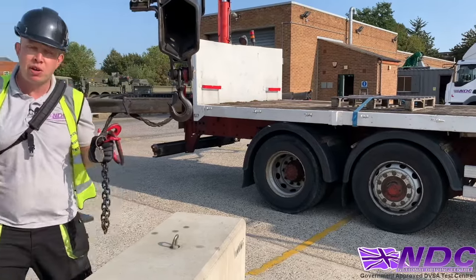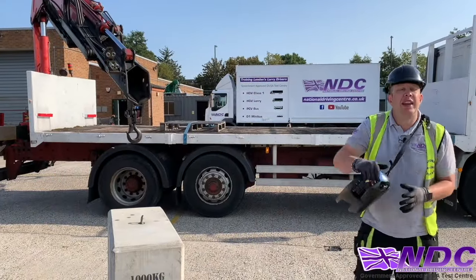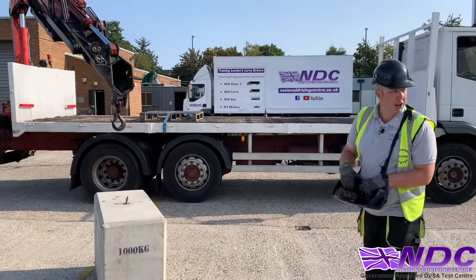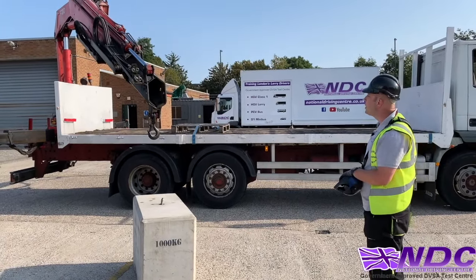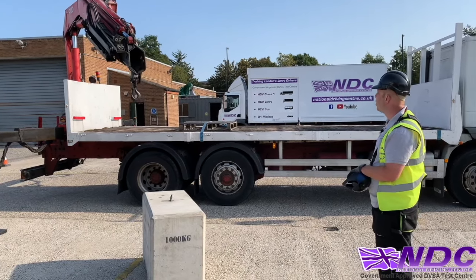Good. Then we'll put our accessories away so that it's not a hazard to anyone and we don't forget it. So now our accessories away, now we're gonna pack the crane away, ready to drive off down the road. So in the opposite direction then, turn the crane on, press once, press twice, still keeping that observation nice and tight. We'll bring that extension in just so there's less crane out in the atmosphere. Nice and slow, nice and steady.